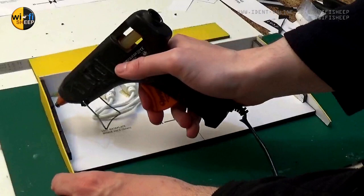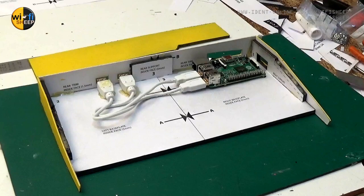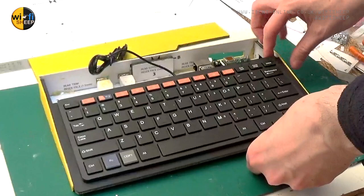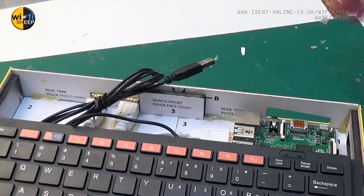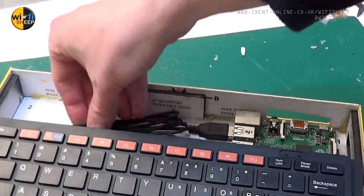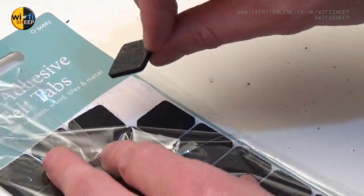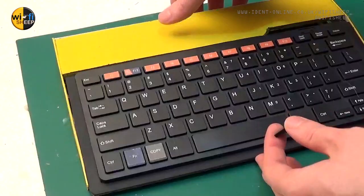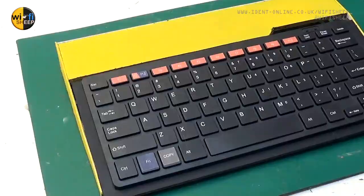With that done, apply hot glue to the tops of the chassis sides, making sure we don't get glue on the outer trim, before finally attaching the keyboard. With the keyboard in, plug its USB lead into one of the two spare top USB ports on the Raspberry Pi board. Once done, the case lid should friction fit in place — this won't require gluing. Finally, take four self-adhesive felt or foam feet pads and attach one to each corner of the underside of the case. This will raise the Micro One off the ground, allowing for better ventilation when running.